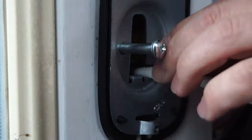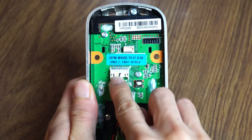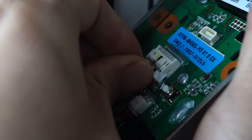The metal tab on the back of the plate should seat into a slot on the opposite side. Once aligned, thread and tighten the two long bolts on either side. On the back of the battery bay assembly, you'll see a connector slot in the middle of the PCB. The mark on the slot will line up with a mark on the cable connector, which only plugs in one way.